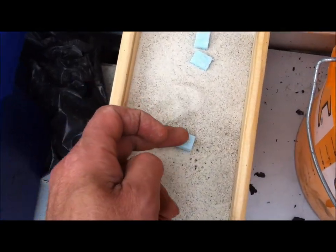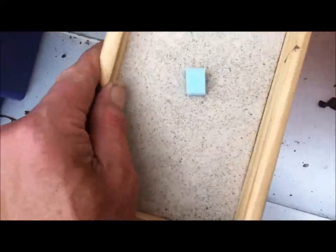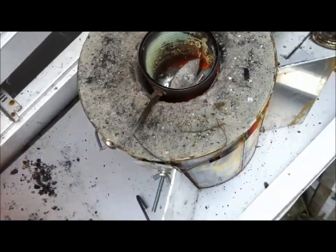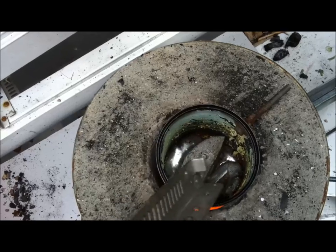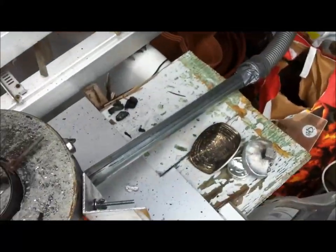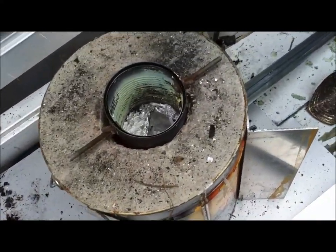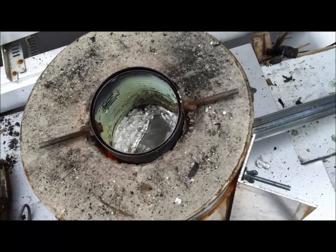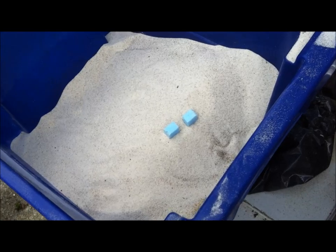So they're the parts. I've buried them in sand, shuffled it down. This stuff's starting to melt. I'll just go and get a stirring stick - another aluminium stirring stick. As you can see, it's liquid inside. I'm going to put my gloves on - I am wearing a hat and safety glasses, so I would definitely recommend that. Just put the last piece in, quite a big lump, so that'll take a bit of time. It's solidified now because that's cold, but it won't take long. I might do another little bit of a refill just to make sure it heats up. It shouldn't be long before I pour it. I did put the bridge in there - see how it goes.